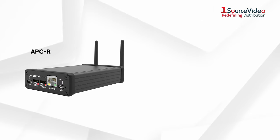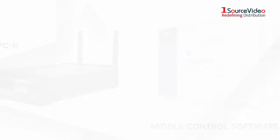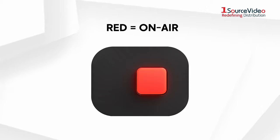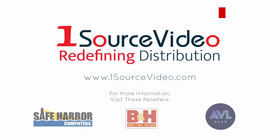Once you have your APCR set up with the Middle control software connected — here, a Blackmagic Design ATEM — just connect the tally to the APCR aux USB-C port and you're ready to go. The Middle Tally will automatically light up in red when the corresponding APCR is on air, and green when the corresponding APCR is on preview.